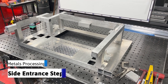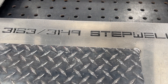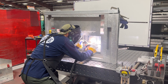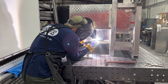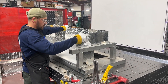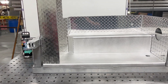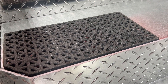Custom templates are used to assure each step well model is consistent and fits snug into the ambulance body when it's installed. The durability of these steps is imperative due to the high traffic area they will be in, so extra precautions are taken to ensure accuracy and stability. Here we can see a completed step well fitting into the template. The space to the left will be recessed storage at the head of the squad bench for oxygen bottles.